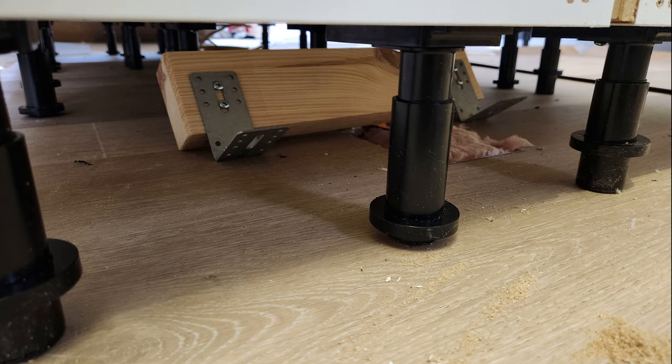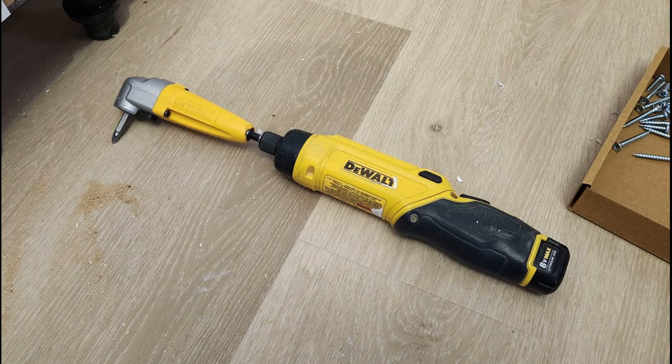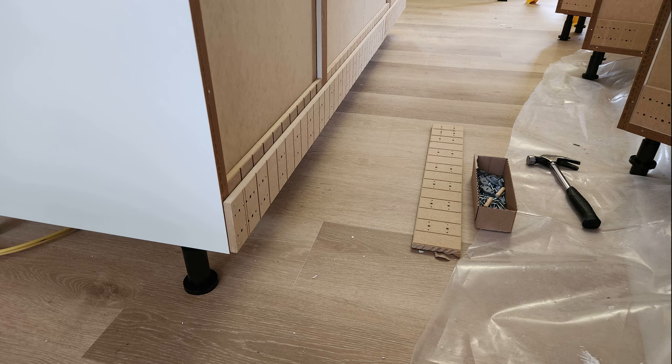In this situation we have a floor where I can put in screws directly. I do not have to remove the cabinets as I did for the single row kitchen because we had a tile floor there. Here I can take my electric screwdriver with a 90-degree angle tool and reach in and screw those brackets directly into the floor without removing the cabinets — makes it a little bit easier and faster. Now we're getting to that part where I have to add more distance between the two cabinets in the row. With that first row securely tightened into the floor, I can bring out more of that material from the assembly kit, take some nails, and hammer it to the back of the cabinet.